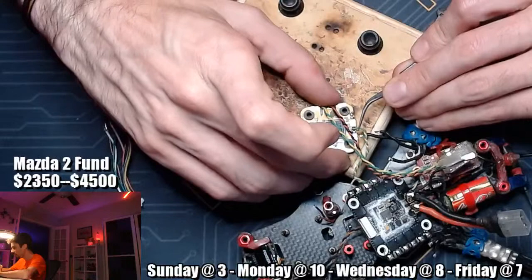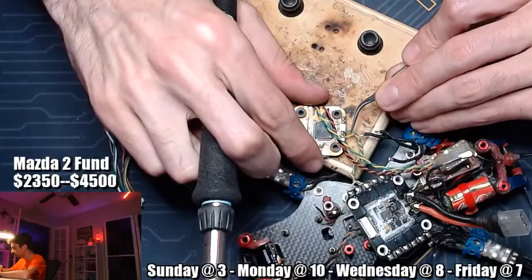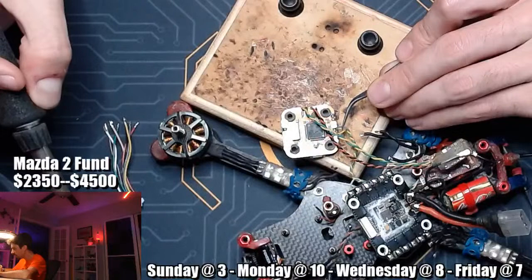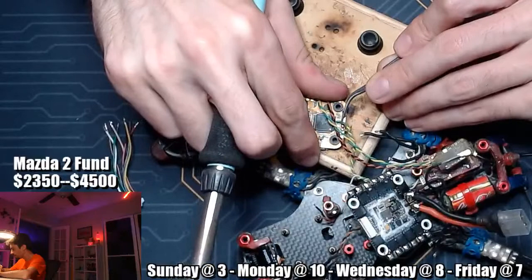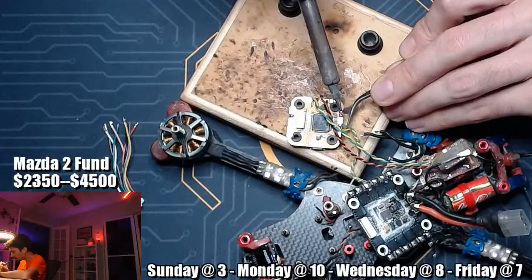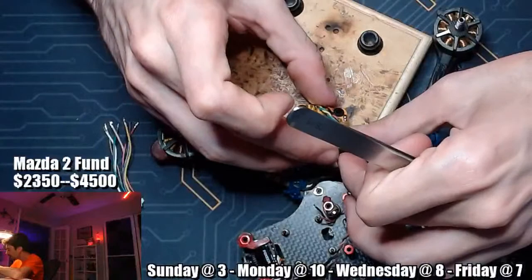Don't just bring the soldering iron in and have this approach of like, oh, I'll fix it once the heat's on it. That's not going to work well. Get it right now so that all you have to do is bring the heat in, touch it for a split second, and move on. Like this. There you go. There's the video out and the smart audio.